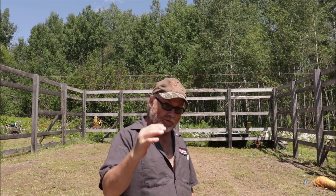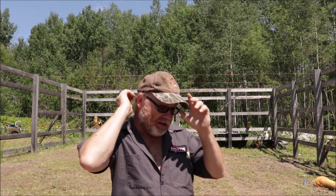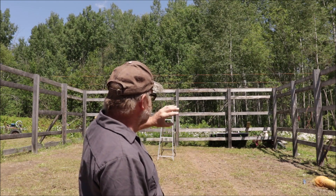Welcome back to the channel. Today we are making sure the top of the building is still pretty level from wall to wall. So far we've checked three places — seven feet apart in three spots from the back wall — and it's still about as perfect as it could be for this building sitting here this long. We're using a string across there and checking with a line level. I also checked with a digital water level that our buddy Bert Skelton sent us when we were doing the basement, and it's bang on too.